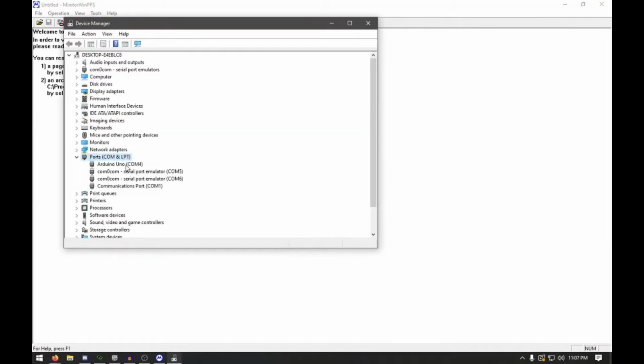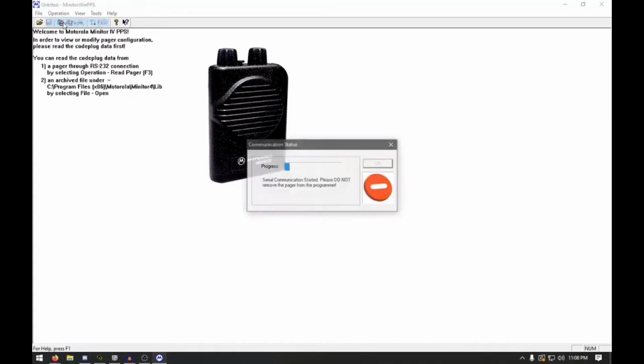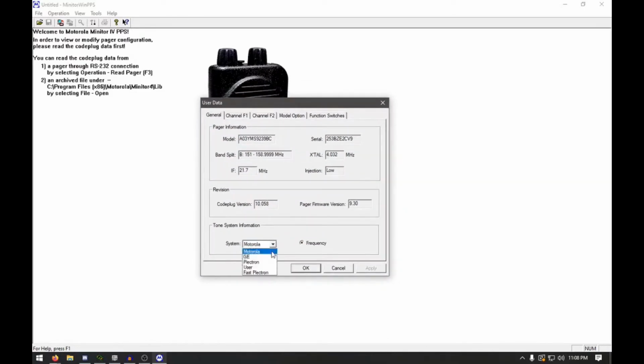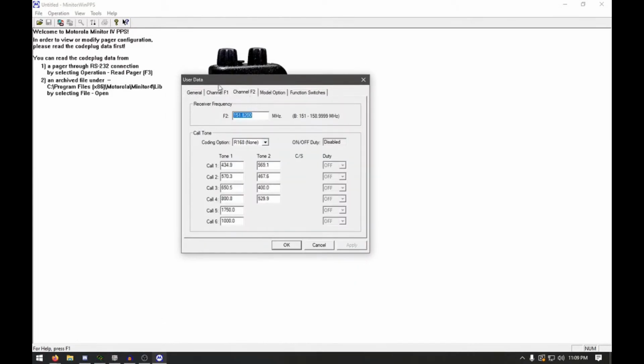Once you've written the code, it's time to upload it to the Arduino. Simply click on the Upload button in the Arduino IDE. If you're using an external programmer, connect it to the ICSP pins on the Arduino and upload the code through the IDE by selecting the correct programmer. After successfully uploading the code, disconnect the Arduino from your computer and power it up using an external source like a battery or a power adapter.